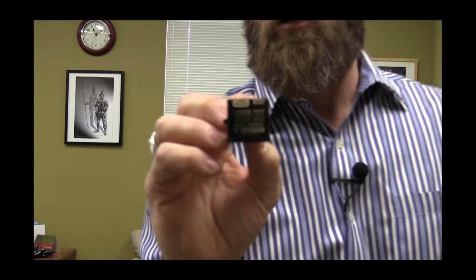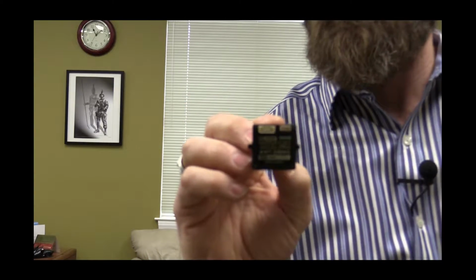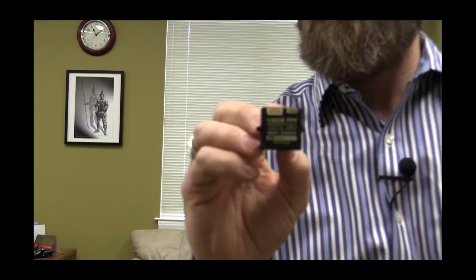Further making convenience for this camera is that it's got the OSD menu port off the back, just like our other cameras that we've talked about in our videos. This little port allows you to use the RC01, that remote control paddle that we offer for all the other cameras that have an OSD port as well. And the menu is pretty consistent as well. If you have an RC01 from one of the other cameras, you can use it with this, program the camera, install it, and walk away.